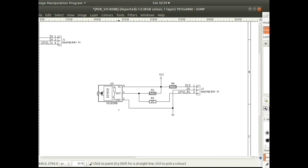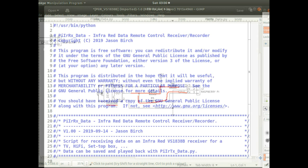The receiving circuit is the VS1838B, and this circuit comes straight off the datasheet. The datasheet suggests having a 100 ohm resistor on the power input line, the output is pulled up through a 100k resistor, and then there's a resistor in line with the GPIO pin just to protect the Raspberry Pi and make sure there's not too much current flowing between the two.